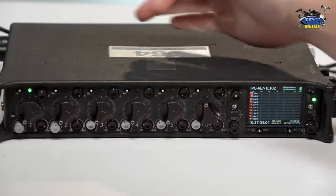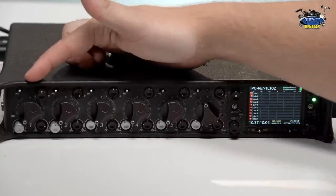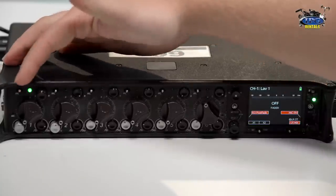The way that you activate your channels is there's the gain jog wheel right here. You go in and you'll hear a little click. I'll just start it off kind of at 12 o'clock. That's going to activate our channel one and two — you can see that they're red now. The mixer is essentially telling you that these channels are active and ready as far as their microphone levels coming in. To do that, you can see that the green is already blinking. You're going to go ahead and flick that pre-fade toggle switch to the right.